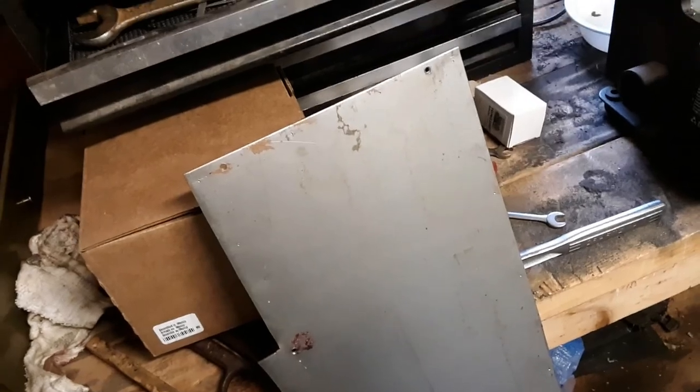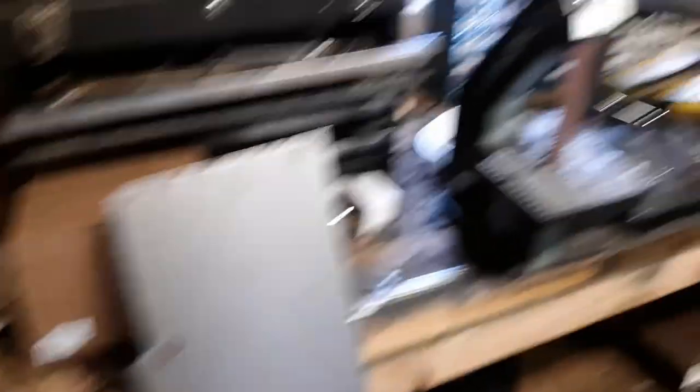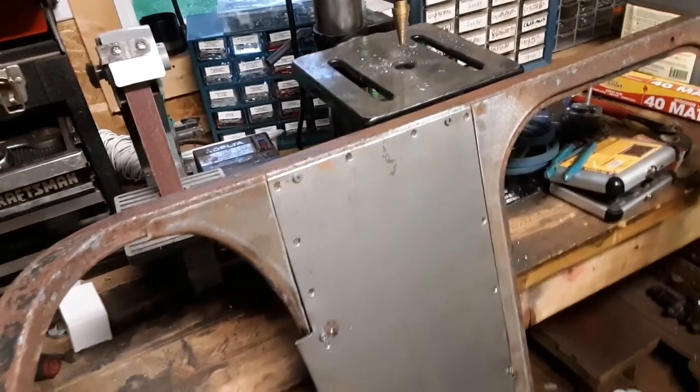Got all my little holes marked with the punch. I actually said to heck with the pen and just took the center punch and made marks that way. Now I'm going to use my drill press to knock them out. Got all my spot welds drilled and I got the piece screwed back on. It didn't quite line back up like I had it before I welded it, but it did pretty good — pretty happy with it.